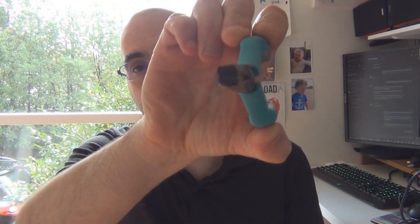So the term literally means to stack one IC on top of the other — you have a sandwich that looks like this. They'd obviously need to be soldered together because you can't just sit one on top of the other; there needs to be a solid connection between those legs. But it would actually work, because on a schematic level you'd have the two inputs connected together, the two outputs connected together, and the power and ground connected together. It should actually work.